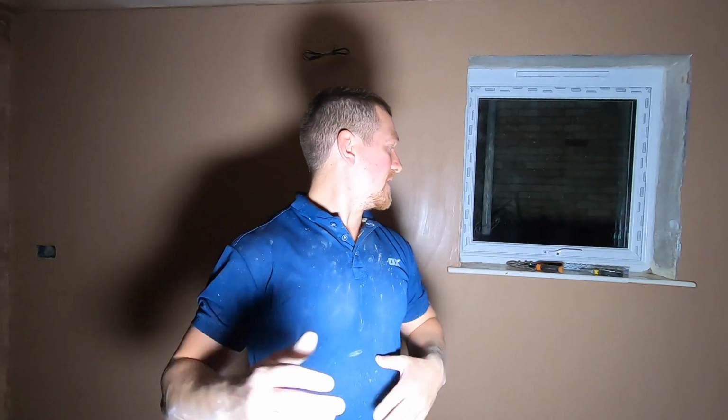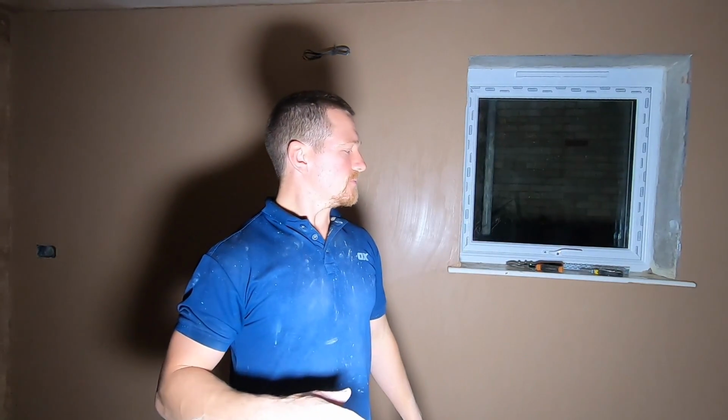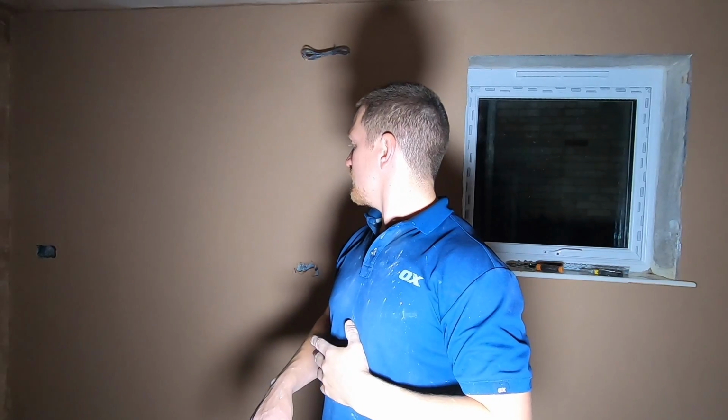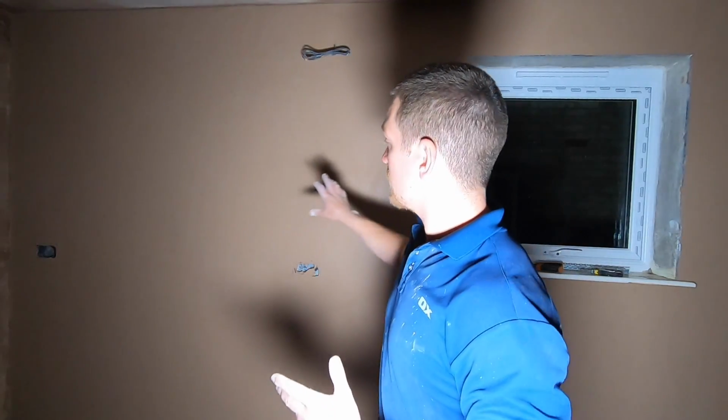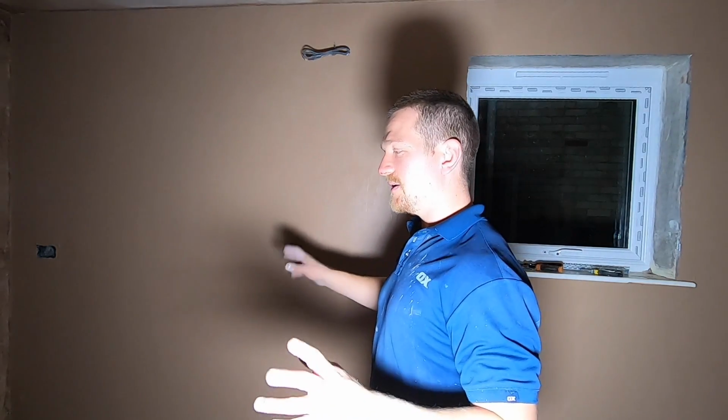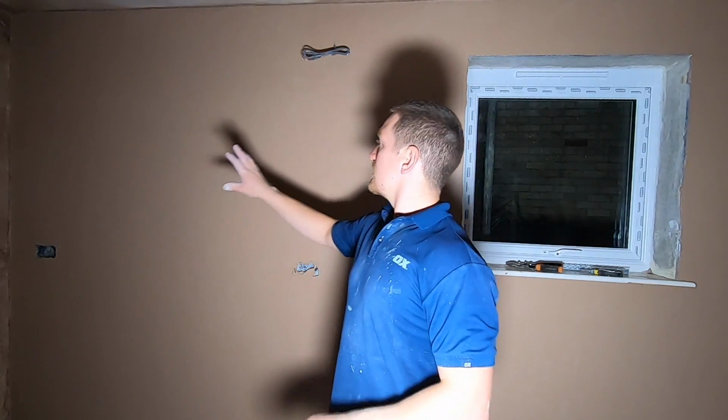So like I said, we're about halfway into it. We've just flattened the second coat. We've got the first trowel to do, second trowel, and then we've got 2 other stages. So I'll go into that. We've got to wait for the plaster to dry a little bit. So once you flatten it with the speed skim, give it 10-15 minutes, and then we're going to start troweling the wall completely nice and flat.